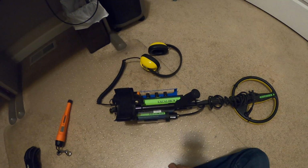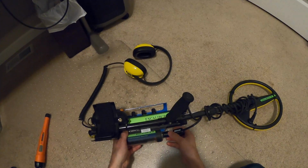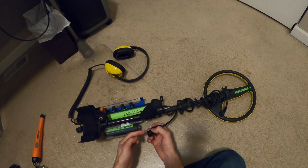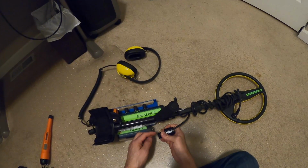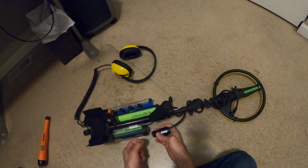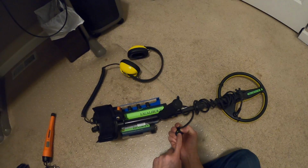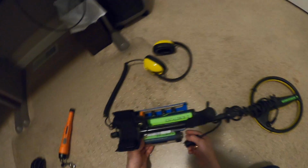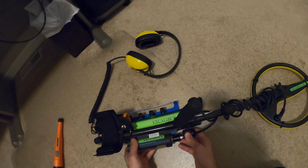I mean, they're not showstoppers, like I said, but we can do better. So the whole thing is to come up with a way, because the battery pack is right here. If we look at the battery pack, if you're not familiar with it, this is just a screw, a machine screw. It's not electrically part of the circuit. It's just for keying it so you don't put it in reverse polarity. And you've got your plus 12 volts and your ground. And it's a nickel metal hydride 12 volt battery pack.